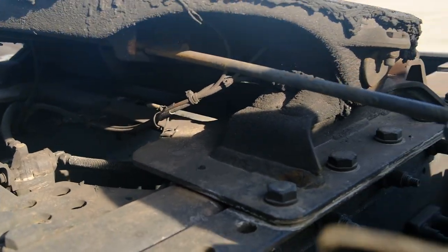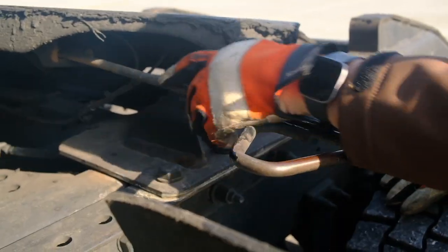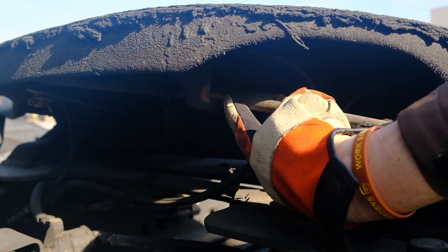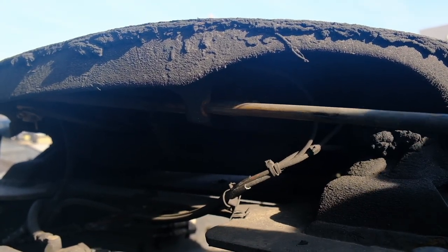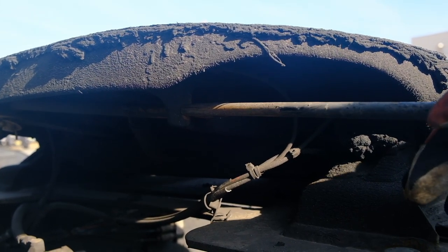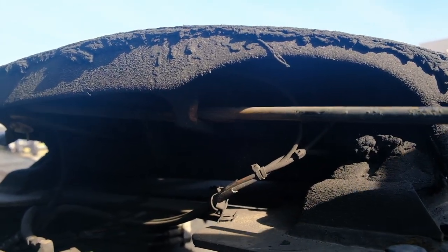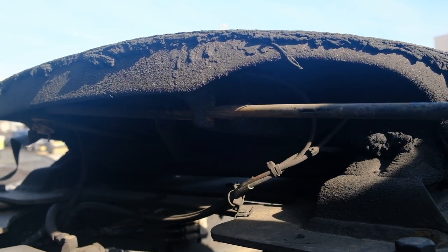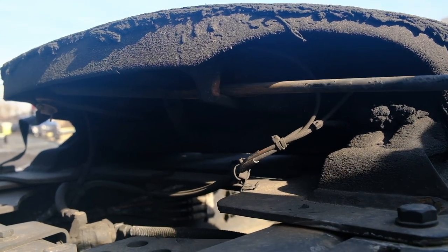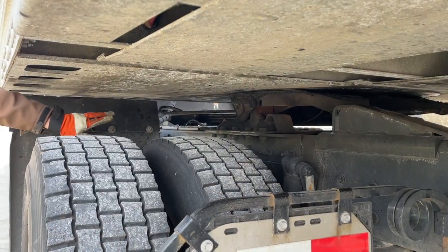When you hook up to the pin it bounces back and shoots in, but sometimes right here we get a little bit of wear on this nub right here. What happens is it gets stuck — when you go to hook, it's just caught on a little lip. A little bit of spray there, a little extra spray there, will help keep that slide happening. When you're experiencing that, all you have to do is pull the handle back and it should kick over and latch around the pin. Always double-check.